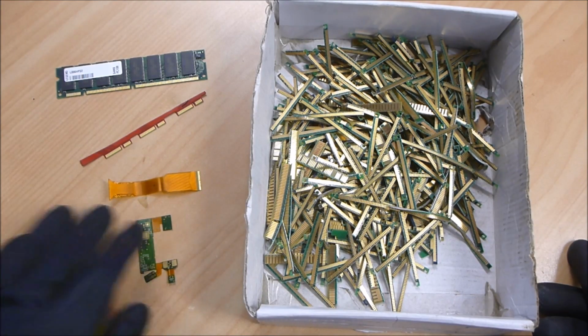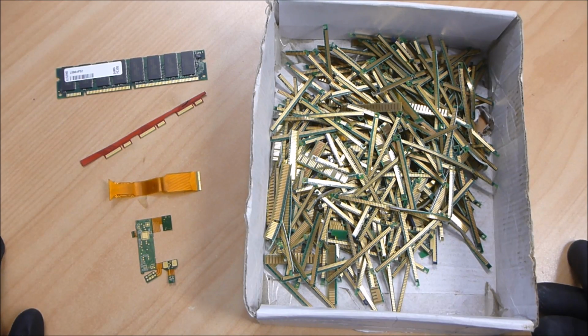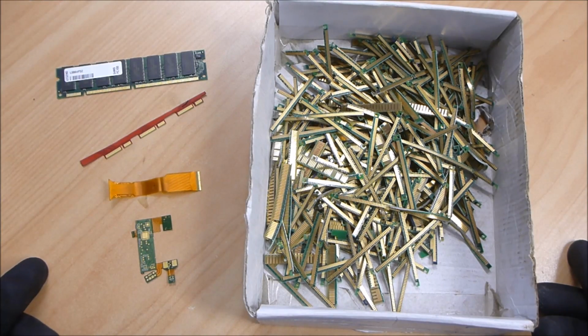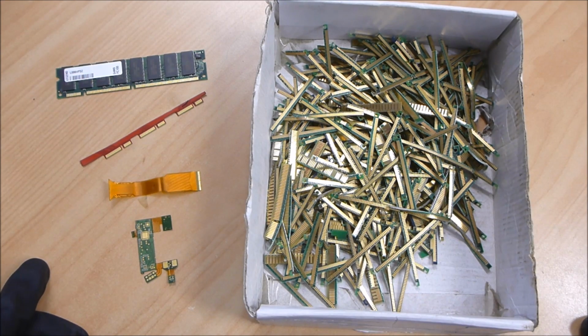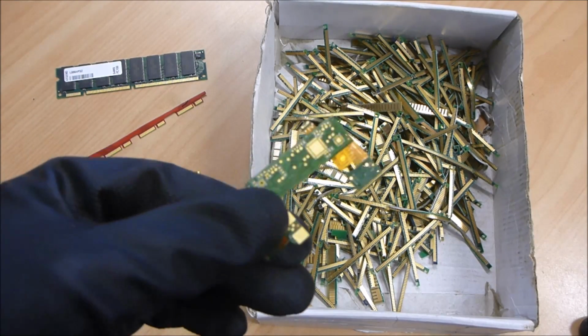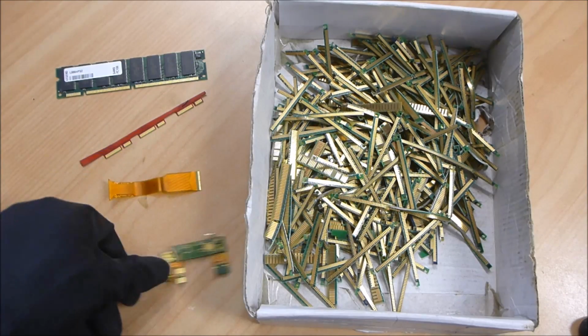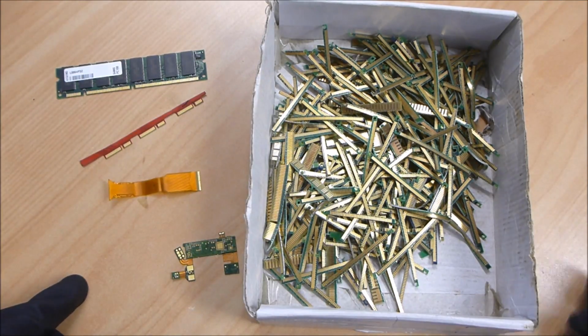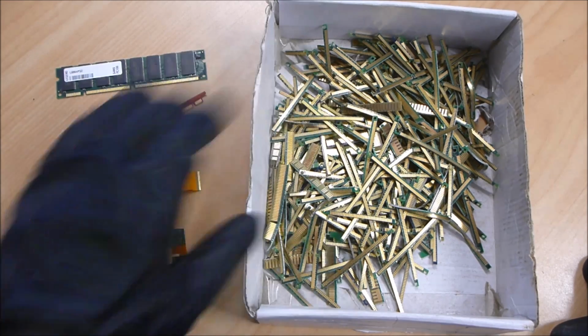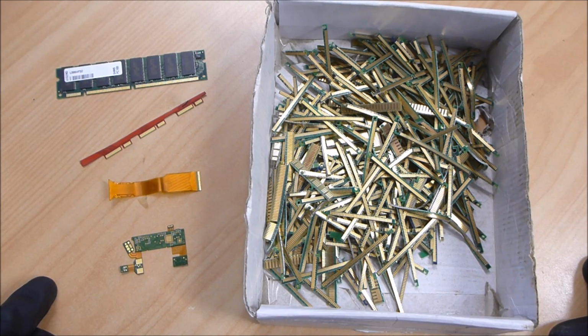So the question that is going to come up is, how would you know the difference between ENIG and hard gold plating? Now obviously the function of the card or the function of the thing you're processing would be a very good indication to you. If the gold plating is generally just there to protect the pads until you solder to them, then it's very likely to be ENIG. If the gold plating is part of a mechanical connection where it has to deal with repetitive in and out sliding motion and scraping motion, then it's usually pretty safe that it is a hard gold plating.